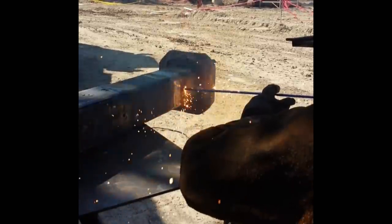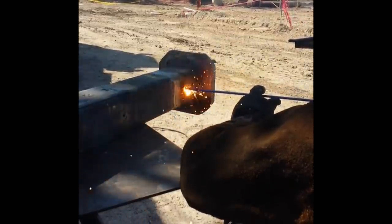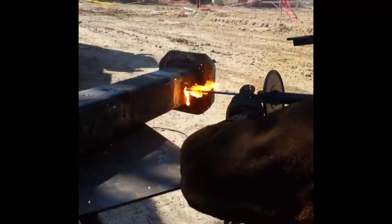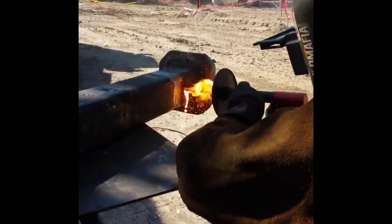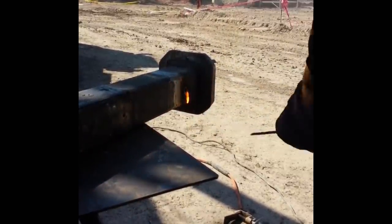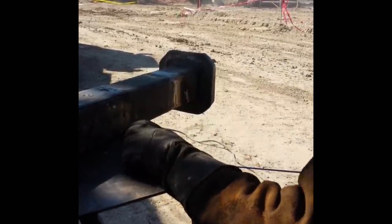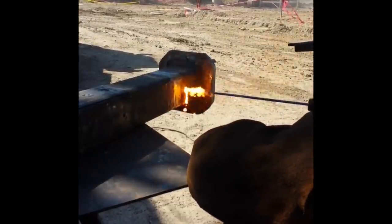As I mentioned, I already marked out where the new pinhole should go. As you're pressing the oxygen lever it's shooting back all the molten metal at you. One of the tricks to be successful is to always have it moving — have that rod moving in and out or around so that it doesn't get stuck with the cooling metal, because it'll get stuck and just create problems. I almost made it all the way through with just that one rod, but they're only 22 to 24 inches long and they burn fast. Next one I'll make it all the way through, then start working my way around the drawing I made on that bar to the correct pin diameter size.